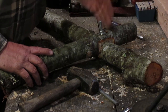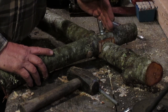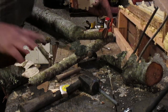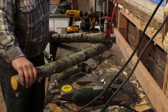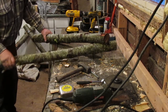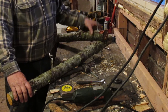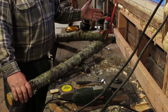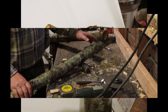If you just keep practicing your bush skills you're going to get better. Let's do a quick review of the three different types. We started out with a basic lap joint, and you'll notice that it holds but there is no rack resistance whatsoever — this thing will just spin almost all the way around, barely impeded. All your racking strength depends on whatever you use to hold the logs together, be it cordage, a bolt, nails, whatever you have at your disposal. That's what's going to keep these from racking.